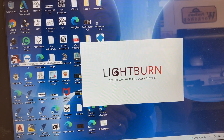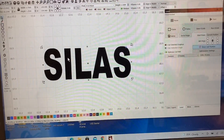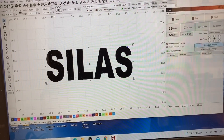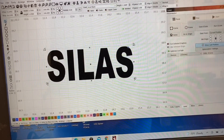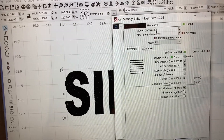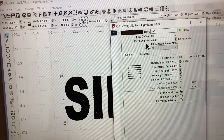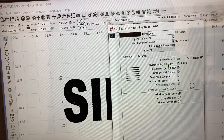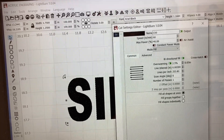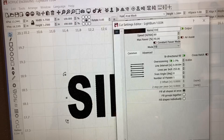Let's open up Lightburn, and I'm going to show you just exactly what I did to set this up. When I started this project, I used one word — the child's name being put onto this project — and I started with a number of different settings. You've got to think about what you're actually engraving on. If it's something like the acrylic, you know you need to have a very low power setting. After several different tests, what worked best for me was a speed around 60 inches per minute with 40 percent power. I kept the over-scanning in position, not using the air assist because it really is not necessary — and that was the setting I finally settled on. This may or may not work for you; you may need to do some additional testing.